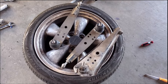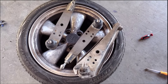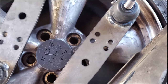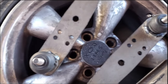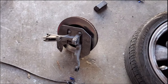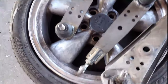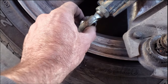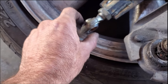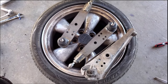The mail lady showed up so now I have two complete control arms ready to go. On the right is the old one; the two new ones are on the left. I screwed up on the holes and had to enlarge two of them by about 30 thousandths - I need to go back and look at the model to figure out what number I put in there. I test-fitted those and they seem to work. I need to go to the store and get a 5/8-to-half piece of tube, and then figure out a way to keep the inner heim joint from moving around.